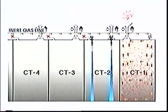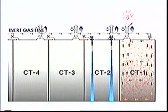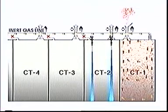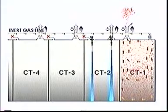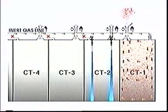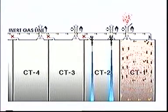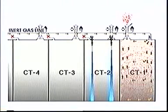You have to purge a cleaned tank to avoid getting into a situation where the vessel is no longer inert. This means that you must ventilate the tank with inert gas to get rid of the hydrocarbons from the mixture of gas left in the tank. No hydrocarbons means no risk of creating an explosive environment when oxygen is later added during ventilation with fresh air. The inert gas valves should be closed to the tanks not being purged. Check oxygen levels in the tank you're cleaning.